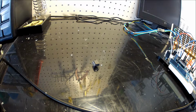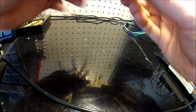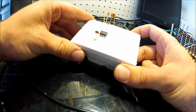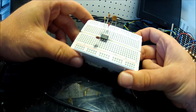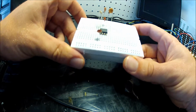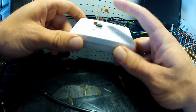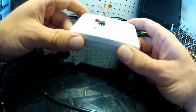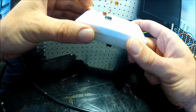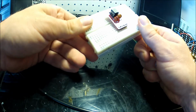However, the chip does have several important downsides. One of the biggest downsides is the amount of space on a breadboard that its support circuitry can take up. You need 4 capacitors and a resistor, along with 3 jumpers going to the Arduino, and 1 jumper going across this capacitor to your audio input. Now this setup would work perfectly fine, but here at cenTex Photonics, we've simplified the matter for use in integrated projects.